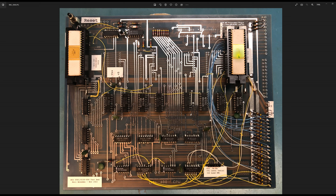There are some logic changes that have to be made on the board for standalone use — a trace cut and some wiring configurations to get the TIM chip addressed and enabled correctly. That's what the wire-wrap wires you see down here are for. On the OSI 400 board there are extra pads on unused pins of devices, meant to allow exactly this kind of modification. In one case I had to go directly to the IC pin because there was no external connection on that pin.